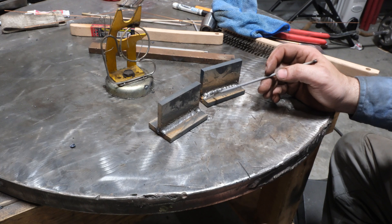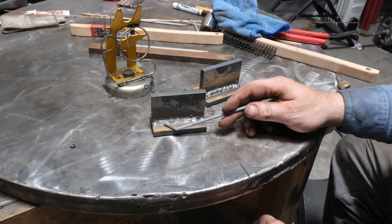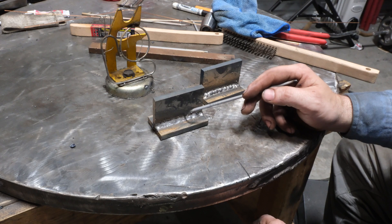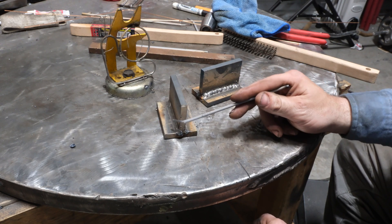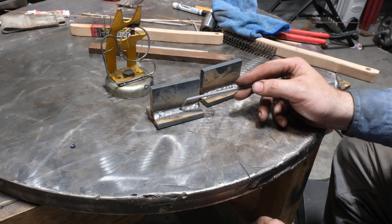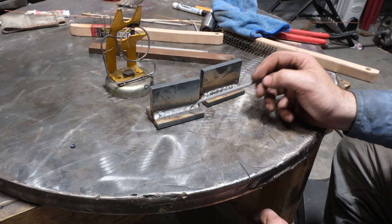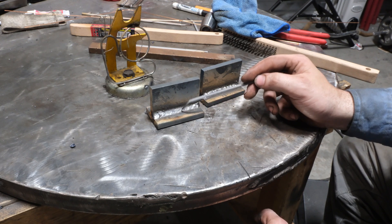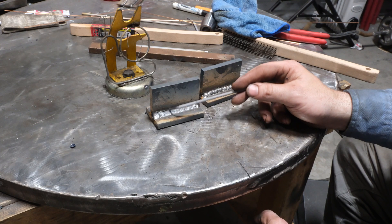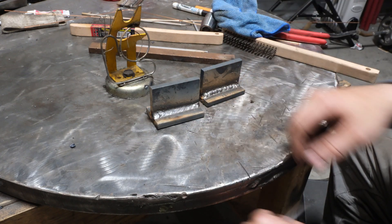So the vertical up is definitely not the best looking weld. I didn't clean these with a wire wheel — couldn't find one — but for what we're doing they'll be fine. Running vertical down with a straight-in, no oscillation technique produces a weld that very much looks like a 7018 run normally — a flatter, cleaner bead profile. A lot of people don't realize 6010 can produce very clean looking welds; you've just got to run it vertical down to get it. The longer arc gap running downhill pushes the arc cone wider, giving a flatter bead profile.